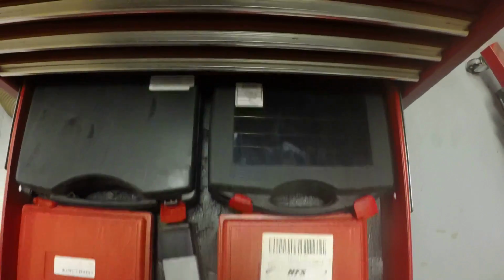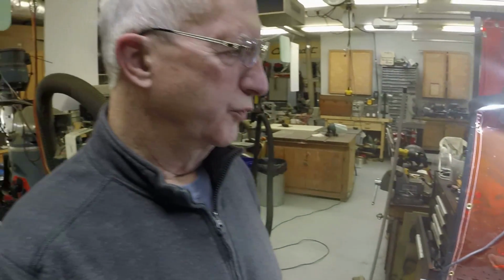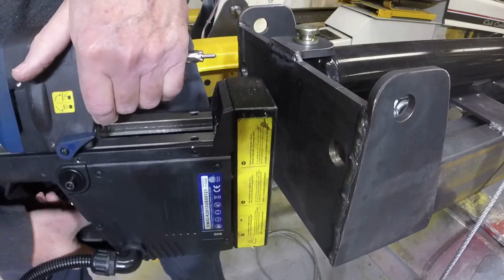Alright, so that's what a mag drill is, and I have a chuck, and most of them come with a Jacobs style chuck where you can put the chuck in and then use regular drill bits in them. And conversely, you can get an adapter. I have an adapter with an R8 taper for the mill, and I can use those Weldon shank cutters in the mill as well, though I haven't had a use for them yet in the mill. Haven't actually done it, but can do that if I need to. So, all right, we're going to get started here. Drill some holes.